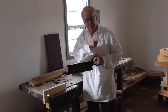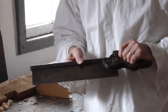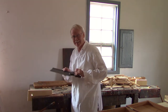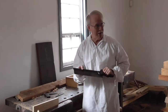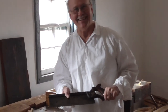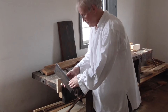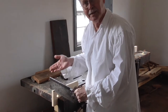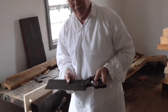We didn't find any of these in this cabinet shop — there probably were some. This is called a back saw. The reason it's called a back saw, you've got the heavy back. They made them in cross-cut or rip, although a lot of cabinet makers just used a cross-cut because you can rip with a cross-cut saw — it's just not as fast. And these aren't for fast cutting, these are for fine cutting, like making dovetails and stuff like that. They even have a smaller one called a dovetail saw. This is your basic back saw. The handle is angled up more so that you're not having to get yourself down as low. This would be used for cutting the fine cuts, like dovetails, things like that.